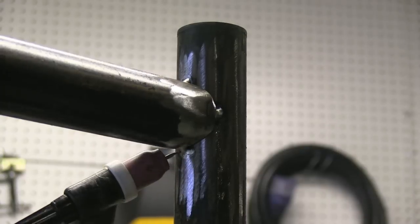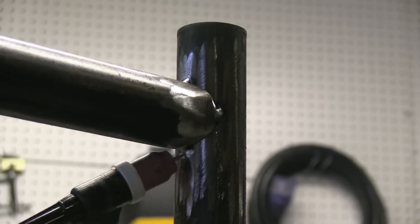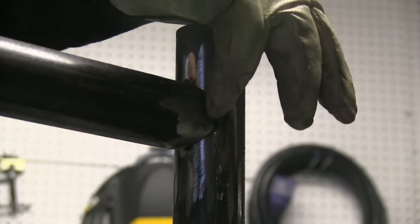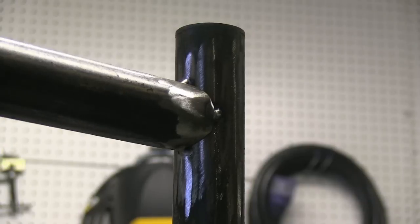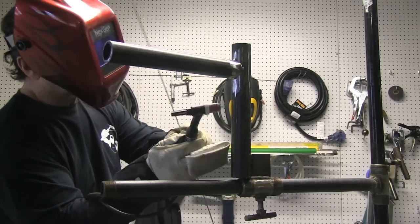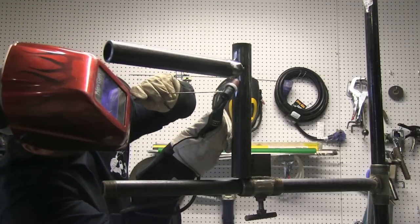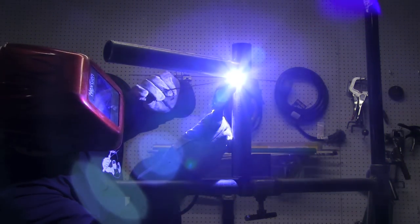I'll position one like this too so we're welding the bottom, the top, and then the sides vertical up. What I would do here is weld the bottom first, because the weld metal is going to shrink. If I weld the whole thing from bottom to top it's going to really want to draw up. But if I weld a good inch or so on the bottom first, then the weld metal will shrink and it'll kind of pivot on those two side tacks and pull it downward a little bit — not much, just a little bit. Then it's easy to pull it upward. It's going to want to pull upward and I can weld uphill on the sides, and it'll always pull in the direction of travel of the bead.